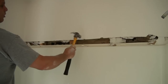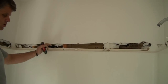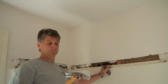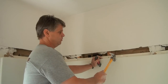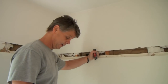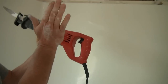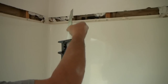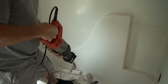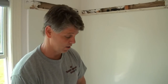So that's where I'm going to go in with my Sawzall at the top of my flange. I'm going to cut this tub into four or five different pieces. If you're going to use a Sawzall, use a bi-metal blade, which means it cuts metal or wood. Don't just use a wood blade because it's a little too rugged for fiberglass — you want something with a little finer teeth. I've got a bi-metal blade in here. This is my Sawzall with a reciprocating blade that goes in and out real fast. That's how you get a fiberglass one-piece tub out of your house.